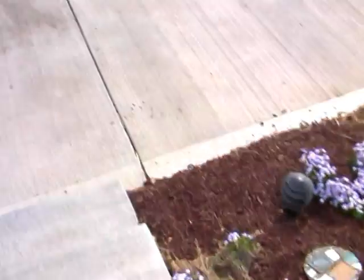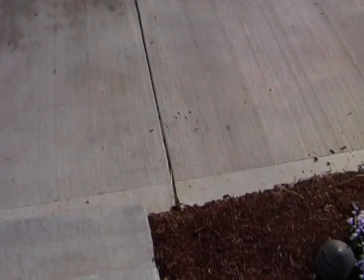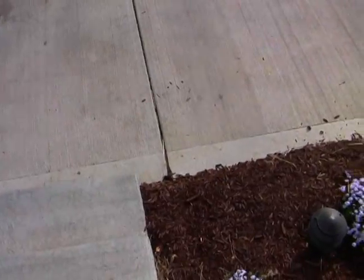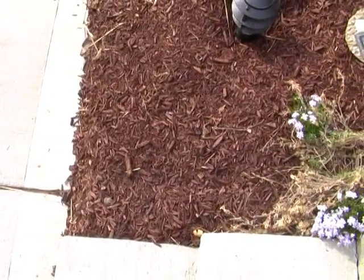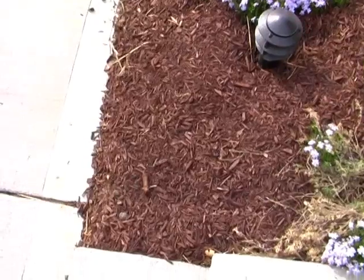It goes deep into here. I dug the trench, but right before we redid the driveway, I put conduit under this driveway with some 12 gauge wire that's meant to be buried. So I have a connection here on it. I used that connector at Home Depot that has that black rubber around it, and you heat it up and it seals everything. So it comes under here,